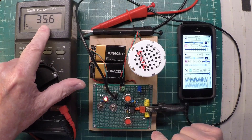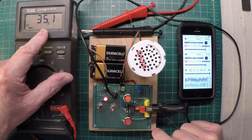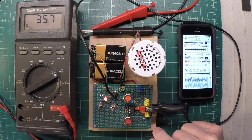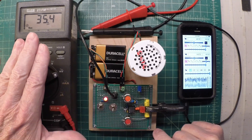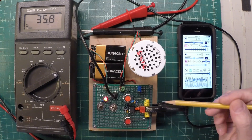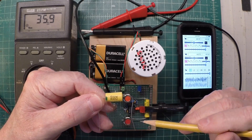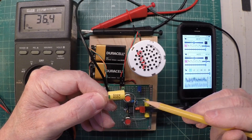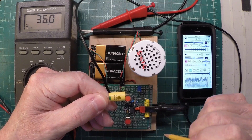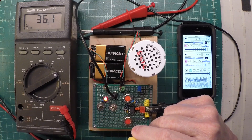Which is already denoted here with my green dot. You can see the representation here as well. Let me grab another capacitor that's a little more difficult to discern. You guys can see how using the meter is helpful in identifying the outer foil. Here's one of the capacitors that's kind of problematic — a 0.006 microfarad. Let me get this hooked up and we'll take note of the meter reading as we toggle the switch back and forth.